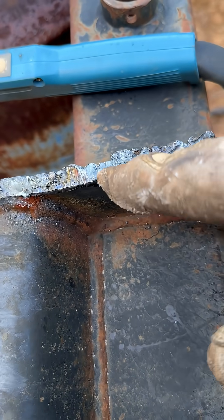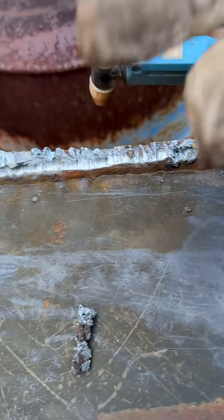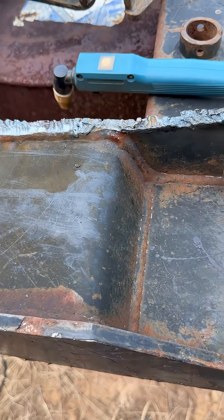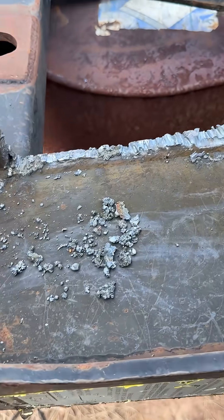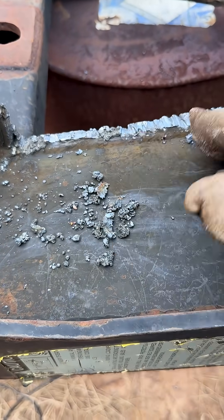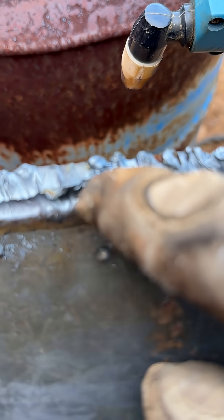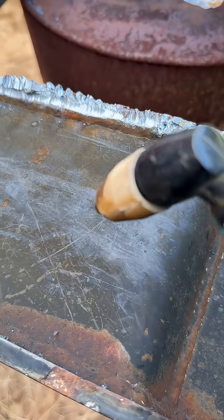You can pick these up for under $200 on Amazon. This is 3/8 inch or 10 millimeter steel and it cut through it — it's not pretty, you're not going to make art with that. This particular one is a 50 amp; it'll cut through anything 3/16ths or smaller pretty clean, about as clean as you can hold it, but you can see where the air blows it out.